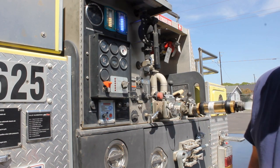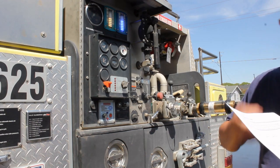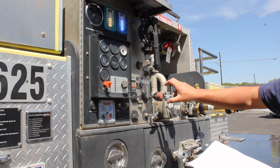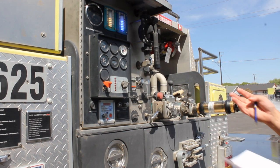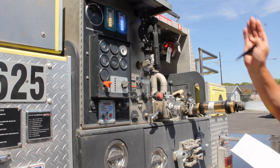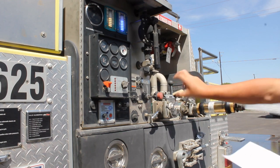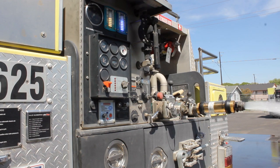No, I got it. That's right. So 55. Okay, you want to do it? Sure. All right, so we're going for 200 psi. We're backed off about a quarter to half a turn here, and it feels like that's in the sweet spot for RPM. It's a feel thing, kind of. So mostly you're dealing with this. Back that off to 200, or open it up so you get to 200, right? And then take a look at this. Then you adjust your RPM a little bit, see if it moves. Copy. Okay, great.